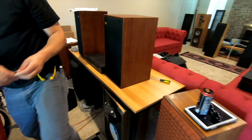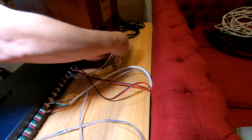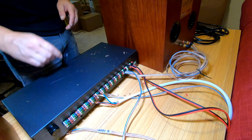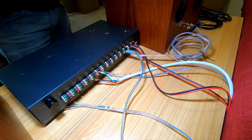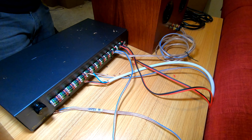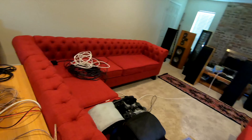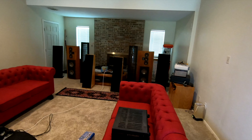As you guys can see here, Thomas is working on getting the speaker selector hooked up. Here on the back — I'll show you what's going on — just doing a little wire management, trimming up these connections. Whenever we got here, they were kind of long and actually shorted out the amp. So we want to make sure all those connections are nice and solid, no bare copper hanging out. These are going to split off to all the rooms, all the stereo zones throughout this room, so he can independently isolate which ones he wants to listen to depending on his mood.